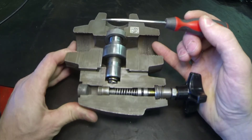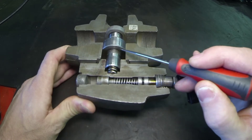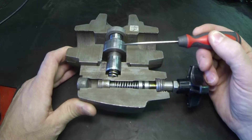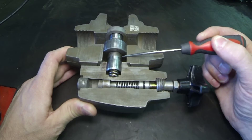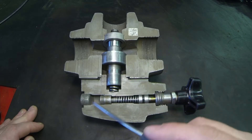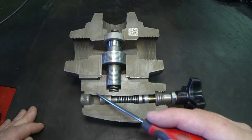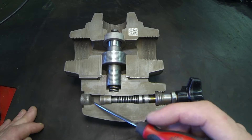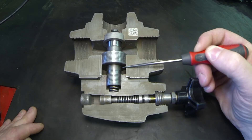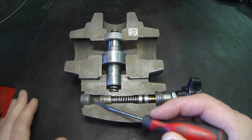There is a small hole that goes through this piston right here — we can see the little hole right there, it's very small. What that means is that the pressure in this cavity is going to be equal to the pressure in this cavity here. Also missing on this cutaway is that in the top section of this housing, there's a passageway that leads that pressurized oil up into this pocket. So the pressure here ends up being the pressure here, and that's going to be the pressure here at any moment while we're operating.